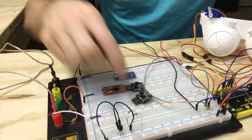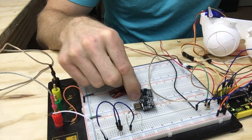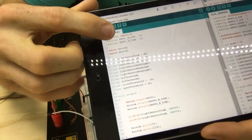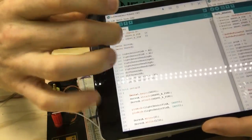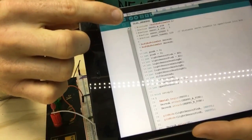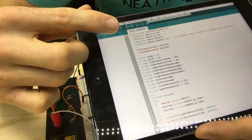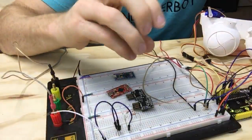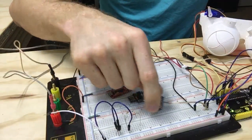It's still plugged into an Arduino Uno. We tried to use a DigiSpark and worked very diligently to make it work. The code we're running now uses the standard servo library, which can move servos very quickly without much delay. The DigiSpark couldn't use the normal servo library, so we had to use this other library — a soft RC pulse library — which is kind of janky. Whenever you try to blink and send commands quickly, it just freaks out and jams up.